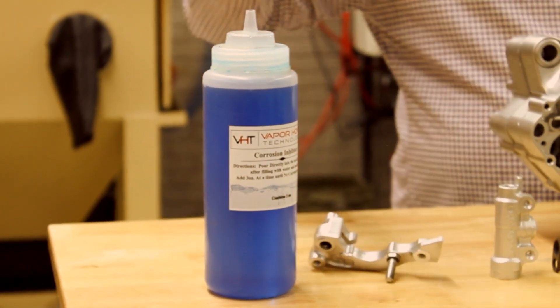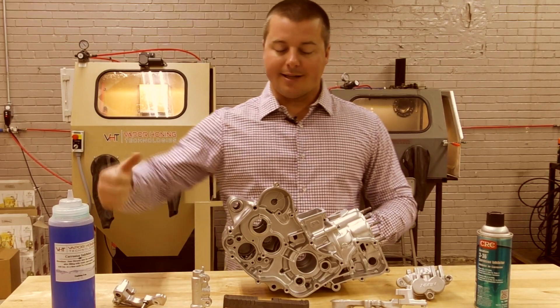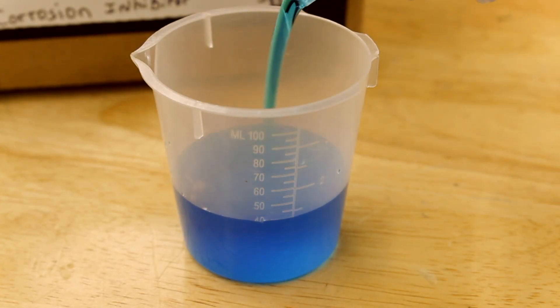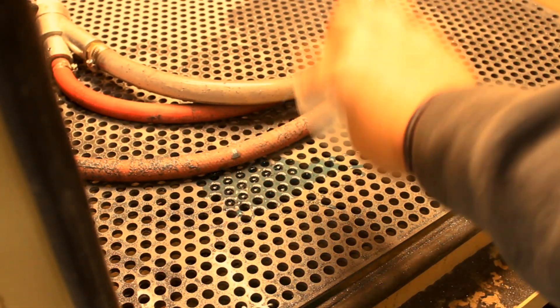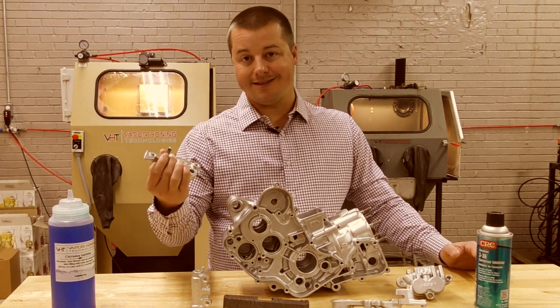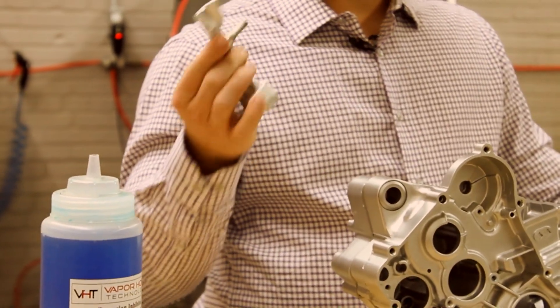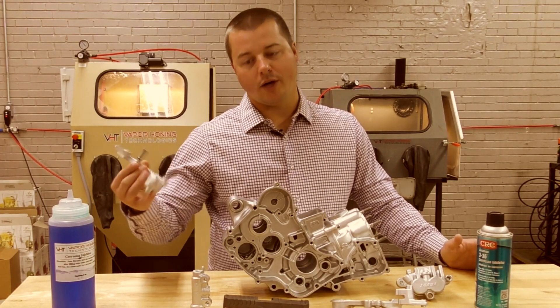The first thing over here on the side, we have in a little squirt bottle that we use in the showroom — we have corrosion inhibitor. This product is added to the machine only one time. Every time you change the abrasive in the machine and the water, you're going to want to add more corrosion inhibitor, but you don't have to add this every day, so it's not an ongoing cost. This particular product is really great on ferrous metals. It has no effect on non-ferrous like aluminum, but ferrous like this stud here — that's steel. This corrosion inhibitor is fantastic when I'm blasting this part, so that it does not come out completely rusted and corroded by the time I'm finished cleaning it or when I'm drying it.